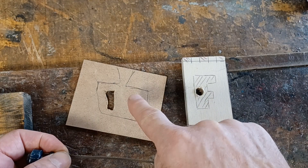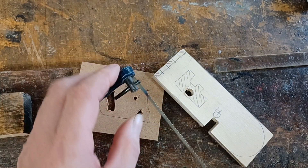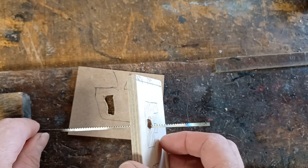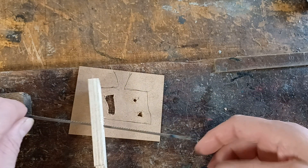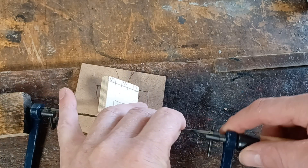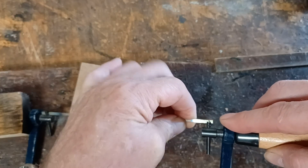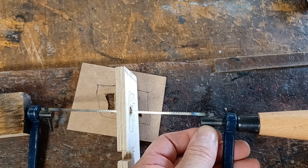You want your marking out to be face up, so that when it's on the saw it's facing the handle. Make sure the end of the blade is kept in this piece, often by putting your finger on the end there, and then you slot this piece of work onto your blade so the blade comes all the way through. Then you can use your thumb and your first finger to apply pressure. Put your pressure on the end here, use your arm to push this way, and you can reconnect that relatively easily by making sure it just drops into this point here — if not, undo it a little bit more until it will fit.